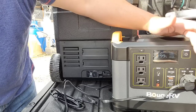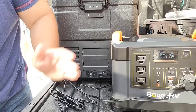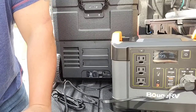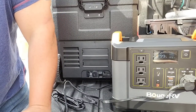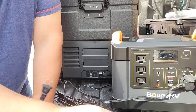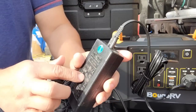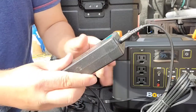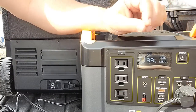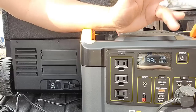I'm going to go ahead and turn off the AC and you can see that consuming DC power, it's consuming on average about 32 or 33 watts — it'll find its equilibrium, so I'd say on average about 32 watts. That's about 12 watts or so less on average than doing it with your AC outlet. Why is that? It's because when this block converts your power to AC power, it uses energy. Ten or twelve watt hours difference may not sound like a lot, but when you spread that out over several hours or 24 hours, it really does add up.